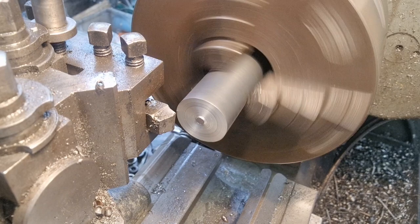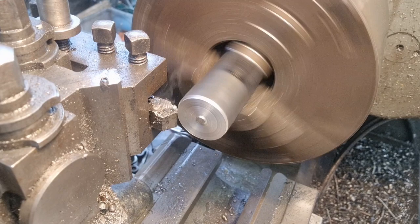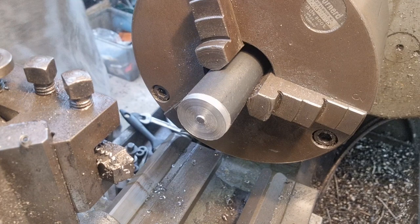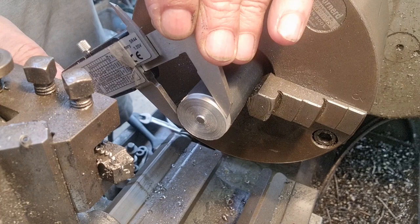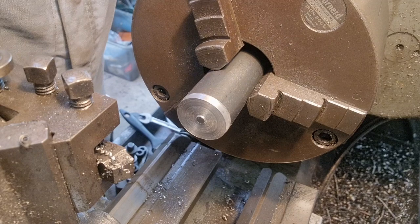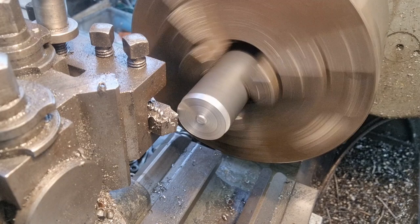Right-o. So, we use the old high-speed steel, take a clean up pass, just hold on, zero me, and in. Put on a 313. I need 13 mil total job, so stub that off there. Stub that now, and see what we're at. We're at 28.8, so I'll set my readout. 28.8, enter, and we want 25, so we'll be straight in for that, straight in for the kill. At 25, which is there. Away she goes, Captain.